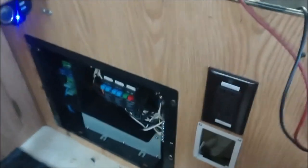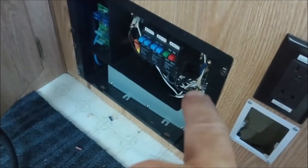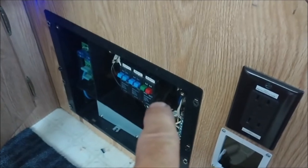I've got a bunch of mess to clean up here. I'll do a little more research tonight on the charging system and try to get that figured out - it's plugged in, and the converter is supposed to be creating DC current to keep the battery charged. My breakers are off, battery is connected, voltage is down to 12.77 DC volts. I'm going to flick the main 30 amp breaker and see if it starts charging.